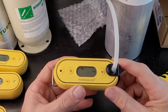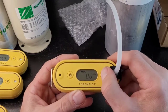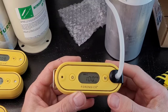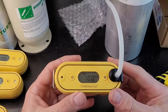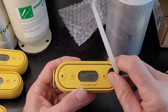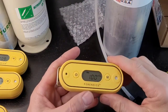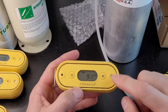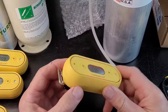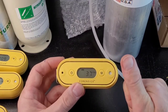We're back after 60 seconds and the value has reached 86. We know we're putting in 100 ppm and it's showing 86 — it's not in calibration. Once it's stabilized, press the menu button to enter — it locks in 100. After a few seconds we're back to normal display mode. The C comes off, it's locked in, live, and reading instantaneous. The alarms are going off because it's exceeded the low-level alarm we set at 40 ppm. Turn off the valve. Make sure you're doing this in a well-ventilated area. The reading starts decreasing as we remove the gas. That's the unboxing, that's the calibration, and that's the full overview of the FD-103 Forensics Detectors waterproof, shockproof gas detector. Have a great day — see you later!